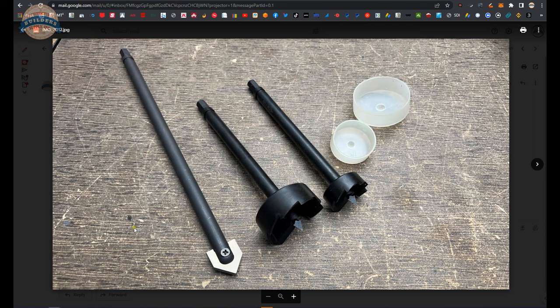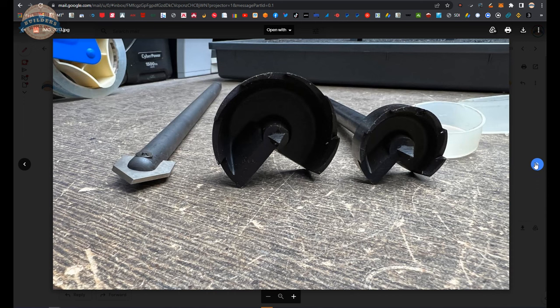Your cutting tools: 1-inch spade, 2 1/8 multi-spur high-speed steel, 1.5 inch high-speed steel. Use that 1.5 inch every time your lock will allow it. Just another view. Those are not self-drilling points or self-starting points. If there were threads cut on those, you would see that. It probably wouldn't be triangular shaped either at that point.